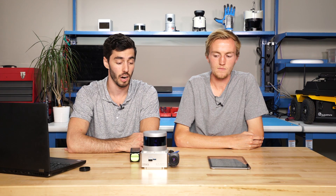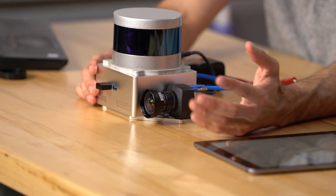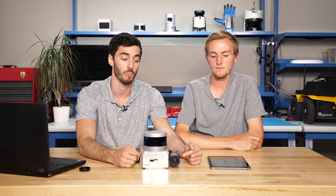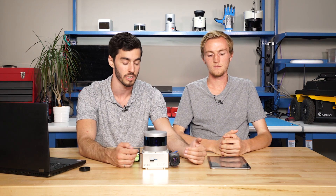There are two different mapping modes: mapping with camera and mapping without camera. Depending on the type of environment you want to map in, you can map using the visual data from the camera or using just the lidar data on its own. If you're doing more aggressive motions or you're in an environment that's not very structured and you can't localize well just based on lidar scans, you can use the visual data from the onboard camera to track environmental features and help localize the unit.